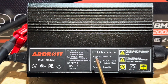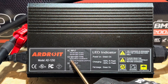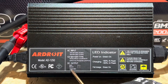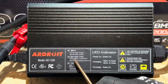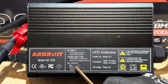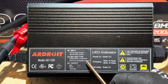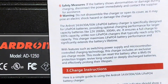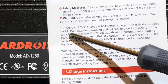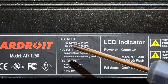For those paying attention to the closeup shots, the Ardroid charger also lists 'ternary lithium' as a 12-volt battery type. However, the voltage output of 14.6 volts does not match a 3S or 4S ternary lithium configuration. This charger is clearly designed for lithium iron phosphate 4S battery packs, and the manual confirms that — so I think that may be a misprint on their sticker.